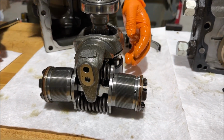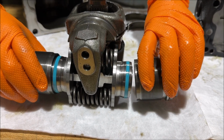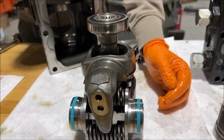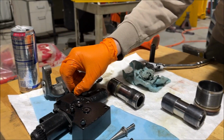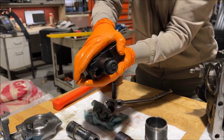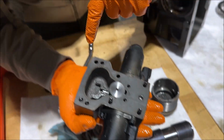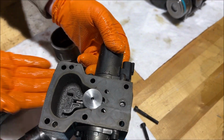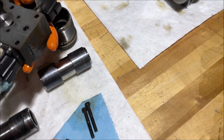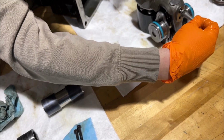So there's the miniature little hydraulic cylinders that control the swash plate. But the fluid control to those little cylinders is this block assembly. Yep. And what you have here, I've taken the springs out. Okay. So this controls, what does this engage? This engages this horn. And the horn's in there. So the horn thread's in there. Okay.